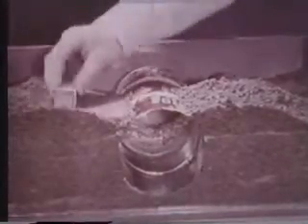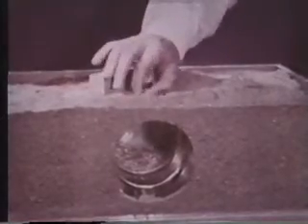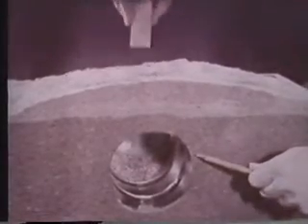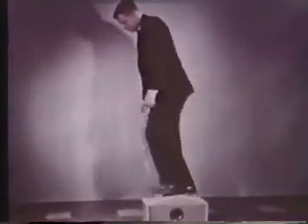When the conduit has been filled up into a strong reinforced structure of steel and earth, the fill above it is made in the usual way. However, the larger pieces of foreign material and big rocks should be removed so that the fill and live loads are distributed evenly. Under pressure, it should be noted that there is no noticeable give at sides or top. When a corrugated steel conduit is built as we've demonstrated, it will safely support unbelievable loads and it will probably cost less. Many engineers have already designed structures using this ring compression method.